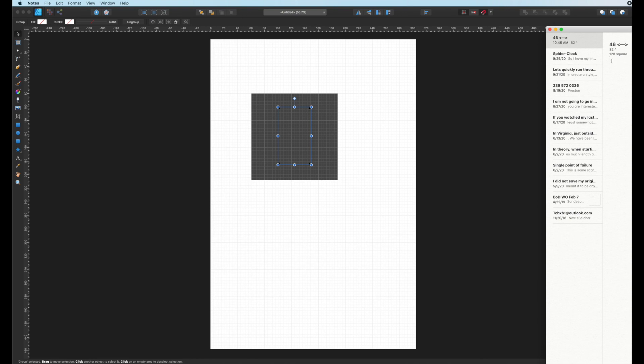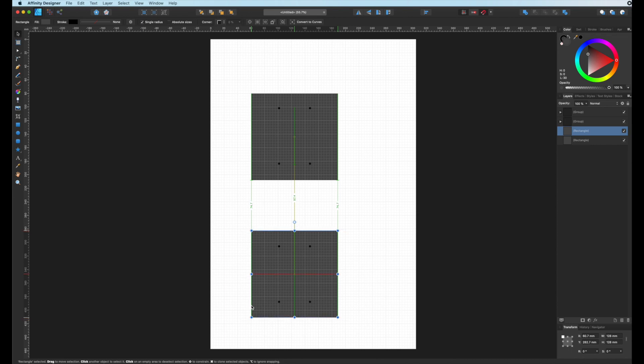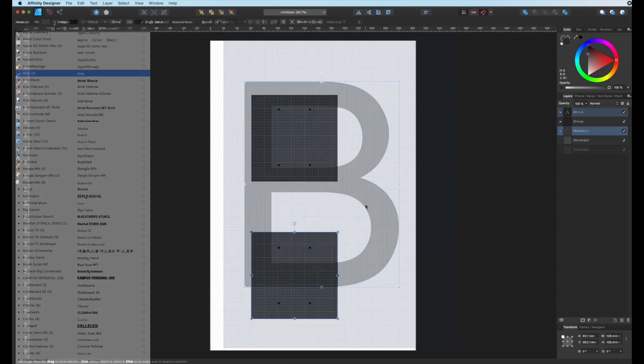I take the size of my screw holes and place them carefully along with my measurements to create a virtual gang box. Then I can copy that and, using the screw holes, place the second below the first at the correct measurement. This gives me a template for both so I can create a design.